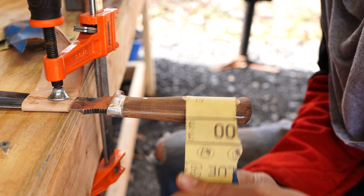The main concern on the blade is the corrosion — it's already caused some pitting that's pretty obvious. But because the blade is so messy in general with all these scratches, it's hard to tell how many little spots we'll be dealing with. So we're going to go over to the rough buffing machine and use this 240 grit compound to make the whole surface of the blade consistent, removing all the little scratches. Once that's done, I can see the specific areas that need more attention, focus in on them, smooth them out, and make the whole blade spot-free.